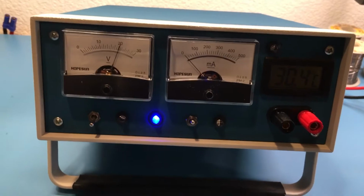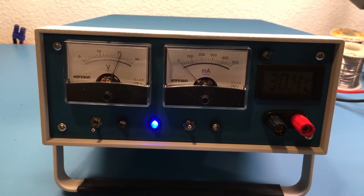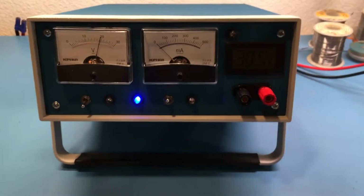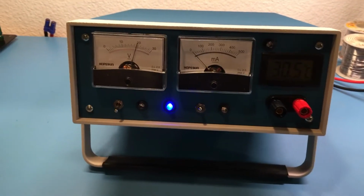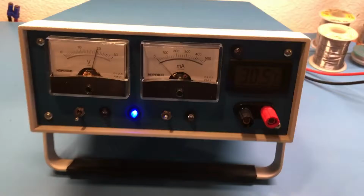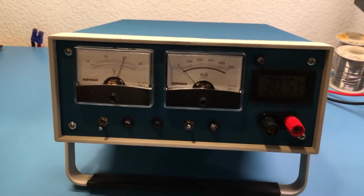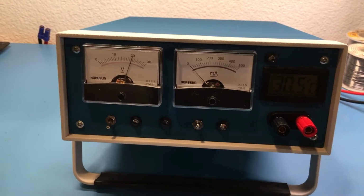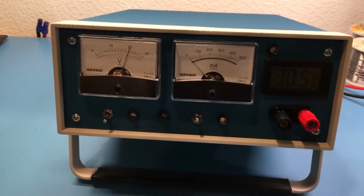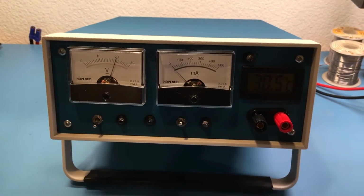Now if I go up to 21 volts, still on external power, 22 volts is still external power, 23 it drops out. And back to 22 and 23. So I also have reverse polarity protection built into it. So this is also handy if you want to run external power to run the reference on all the time. But let's say you have a power outage, no big deal. You have a power outage, we turn our output off, it switches to the internal battery, and the reference alone draws about 25 milliamps. And with the 10 amp hour battery, that will give you, well, a week's worth of operation before the battery will get low. And this LED over here will flash. It's a red flashing LED when the battery starts to get low.